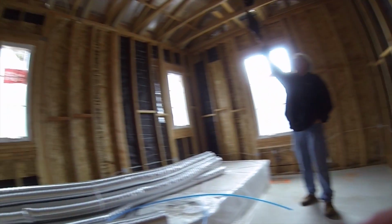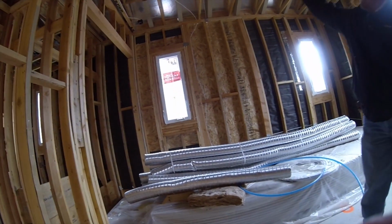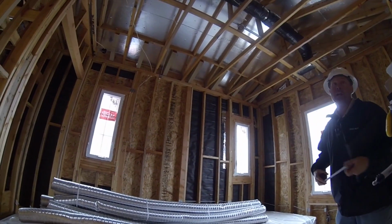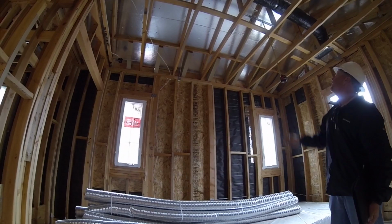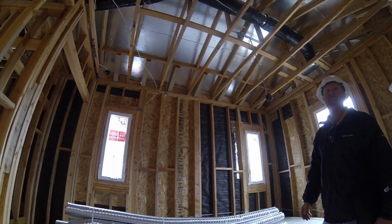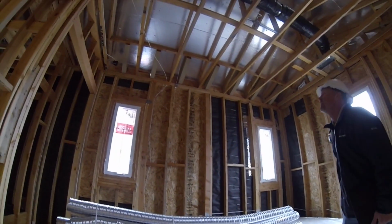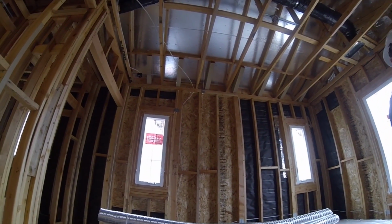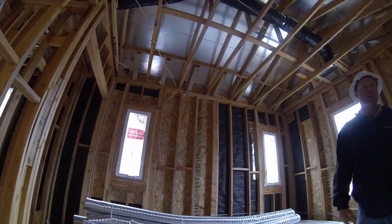All right, so here's one of your options right here. Got a reinforced ceiling outlet right here for a chandelier or fan or whatever you plan on doing there. As you can see, it'll hold quite a bit of weight. Look at that big bracket that's on there. Nice metal hard bracket. That ain't going anywhere. That thing's strong. I guess the main difference between just doing an outlet and a pre-wire for the ceiling. I didn't know you had to have something like that for the lights. Well, otherwise it's just hanging onto the drywall. Yeah, you want something strong and sturdy there.